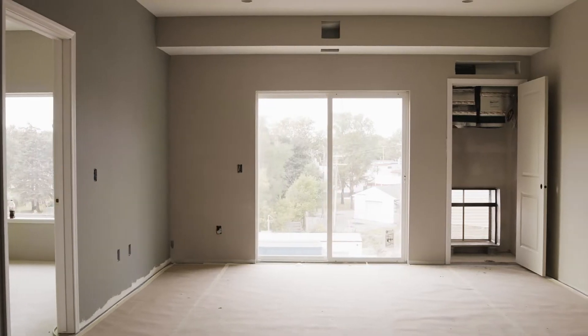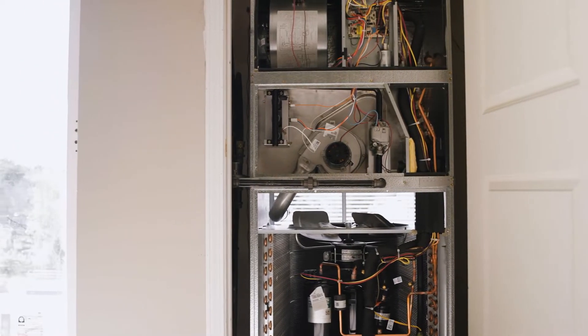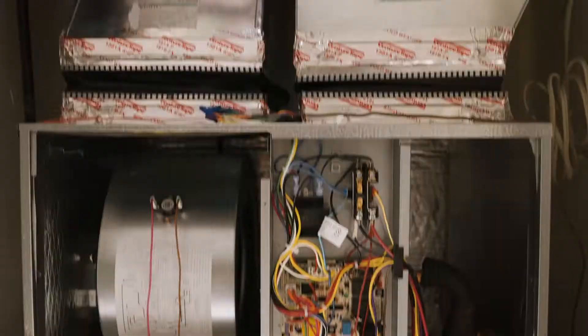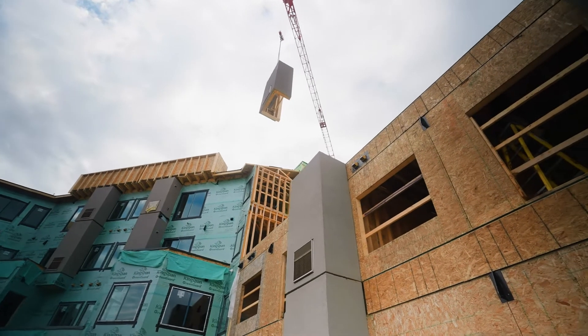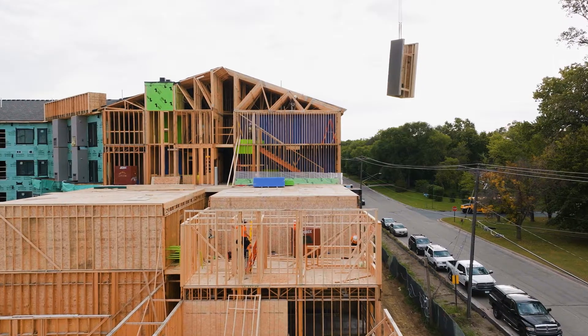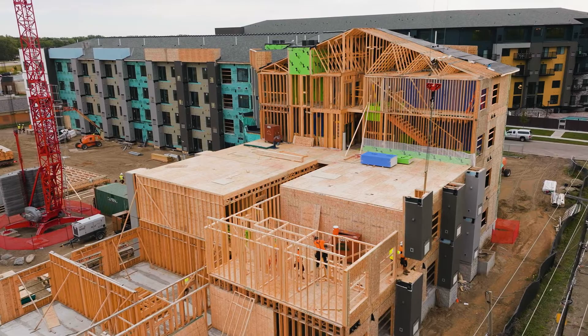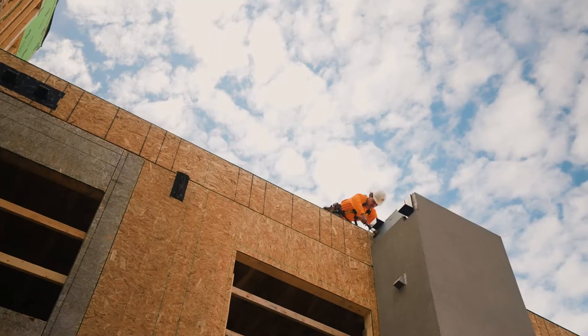We're not having to run extended refrigerant lines. The M-Series provides everything in front of us within a closet in a compact space, and having all of the connections up front in front of that equipment allows us to create a tighter closet around that MagicPak equipment. As we all know with tenant spaces and multi-family, every square foot counts.